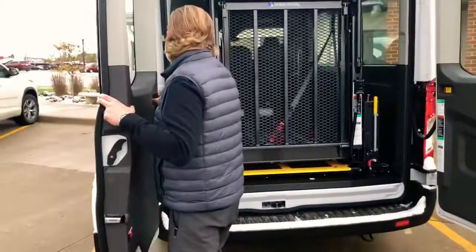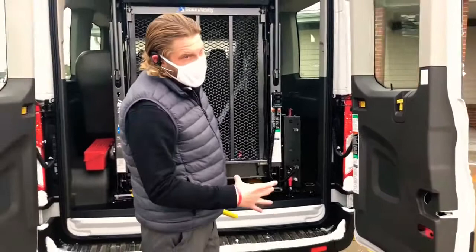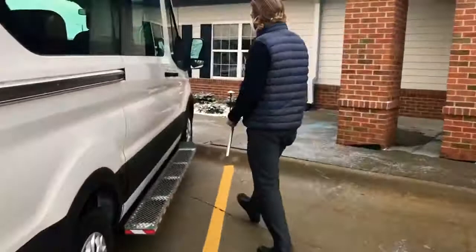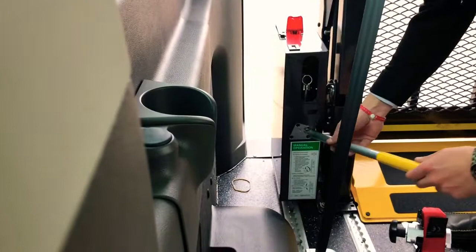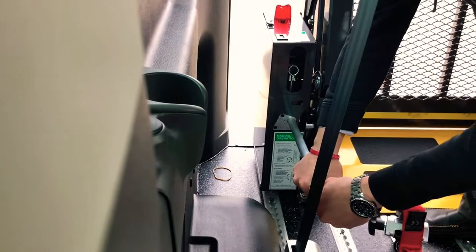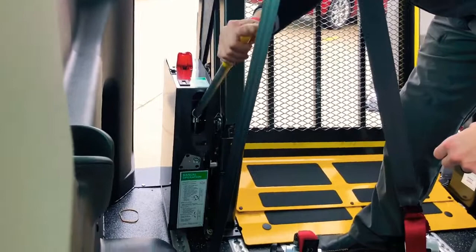There's a handy tool here — it also serves as the jack tool. If for some reason the lift is not operating electrically and someone is stuck, you see these notches right here. This works just like a floor jack: the notches on the end fit into the notches on the lift, and you slowly turn it to the left — like releasing pressure on a floor jack — and it will lower the lift. Make sure it's tightened back up after. Conversely, if the lift is down and you can't get it up, you stick it into the metal cylinder here and pump it up.